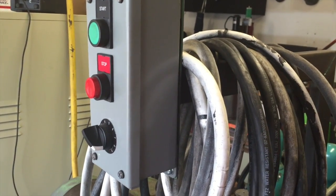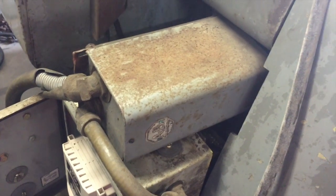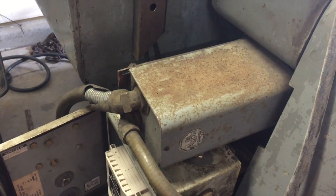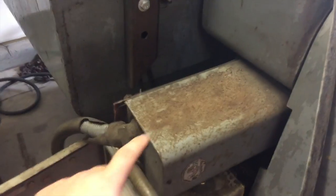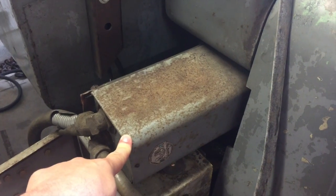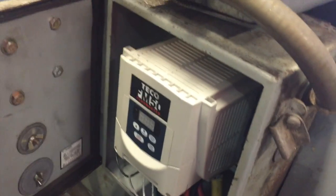Let's stop the video — I'm going to flip it around to the other side of the lathe so you can see the VFD and talk a little bit about how that worked and the gotchas you're going to have to watch for on this. Let's start with the AB selector. That is that five-position lever I showed you — basically the neutral position, then forward low, forward high, reverse low, and reverse high speeds. This is where your six wires are all coming in, and then from here it goes back down out. Effectively, what I did was I gutted all of the analog stuff that was in here and went with the VFD.